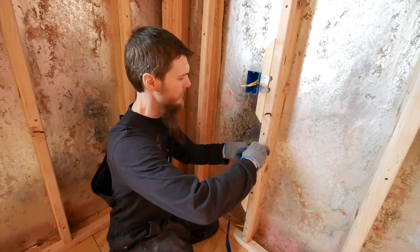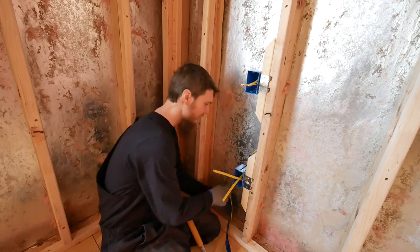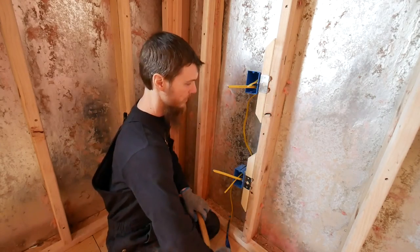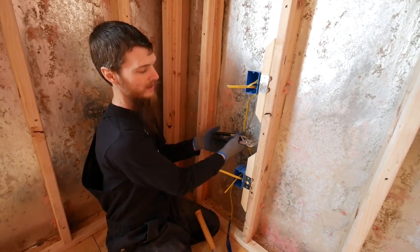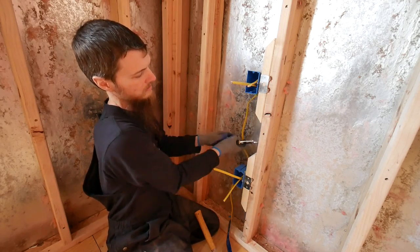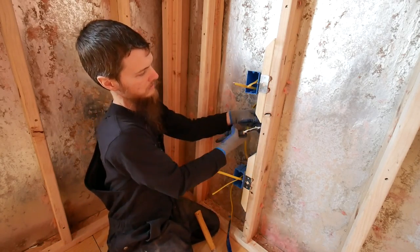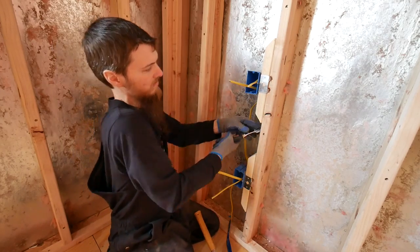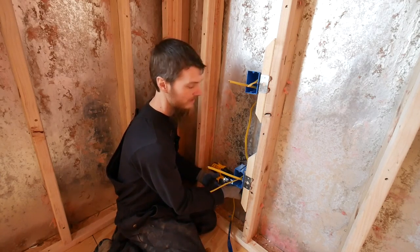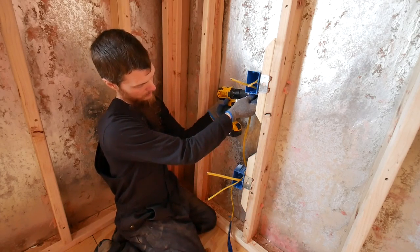I'm prying out the wire staples first without damaging the wires. Now if this had been an interior wall, that's no big deal — use what you got and make it happen. But since we have to insulate this wall, I really shouldn't make it complicated for myself. We want to do this project right, we don't want to cheap out. We're only saving what, a couple dollars worth of wood? You don't always think ahead on everything and sometimes things don't go as well as you hope — so you just have to fix it.